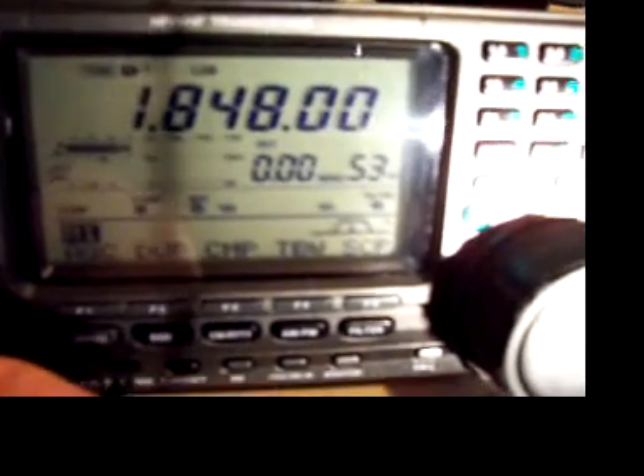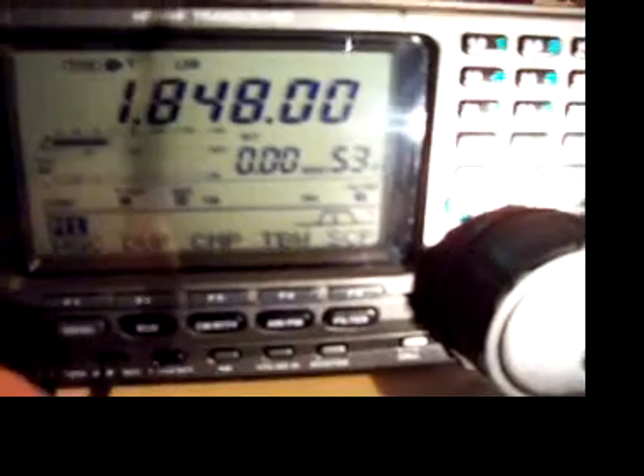That gives you a bit of an idea of how it's working — it's definitely working. What's my noise floor like on 160? With no preamp at all on 160, then with preamp 1 that's about a strength 6 — a sliver of strength 6. Preamp number 2, that's a strength 8. I'd probably only use preamp 1 if I used the preamp at all on 160, on these low bands like I do on 80 meters. So it's about a strength 6 at noise level on 160 using the preamp on the Icom.